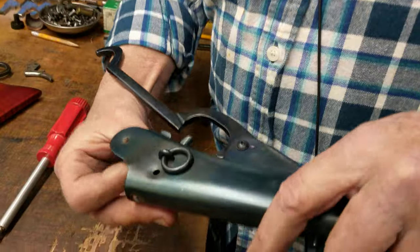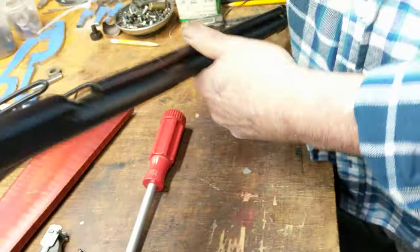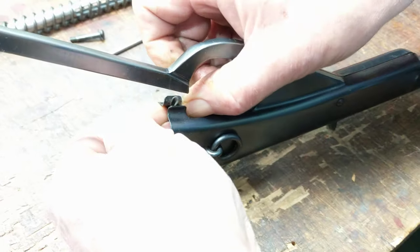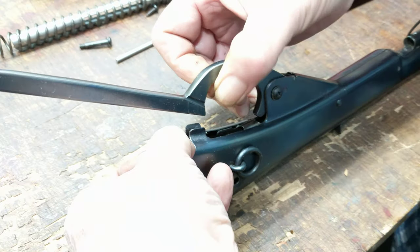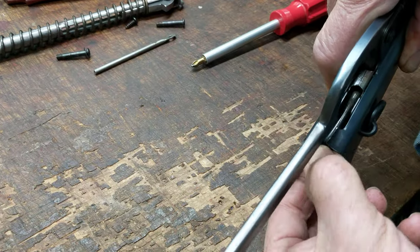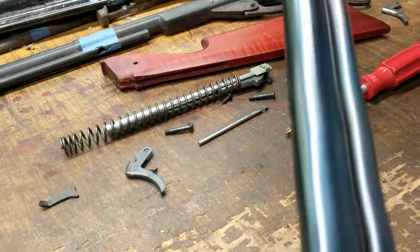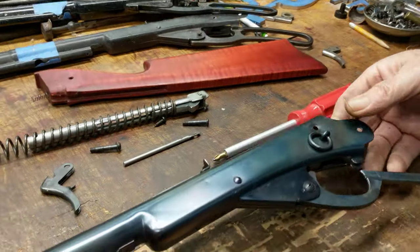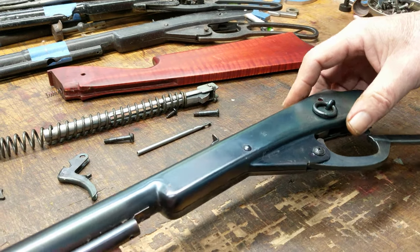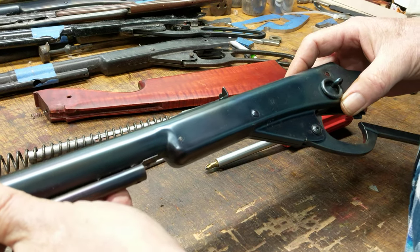You've got to get it up to this position. You've got to spread the back of the receiver to get the trigger through the slot. Then you can pop it up and out. Because of that little bar in there, if you try to do it any other way, you'll discover that you get consistently hung up on the bar. So now we've got our trigger out, our buttstock's removed, our lever is engaged. We're going to move over to the vise and I'm going to show you a simple way to duplicate the effect of having three arms instead of two.